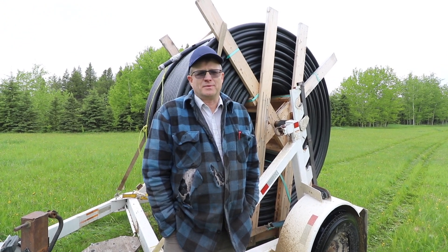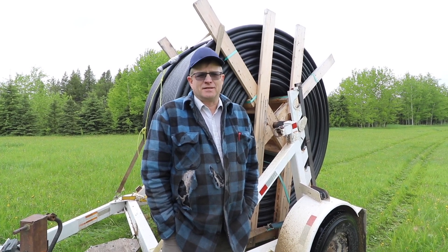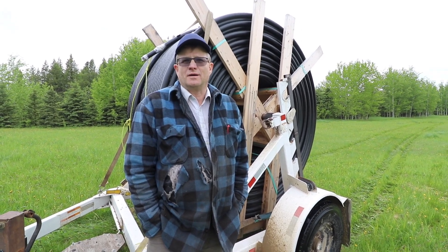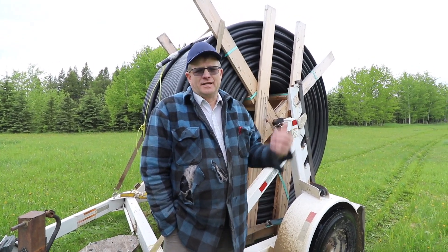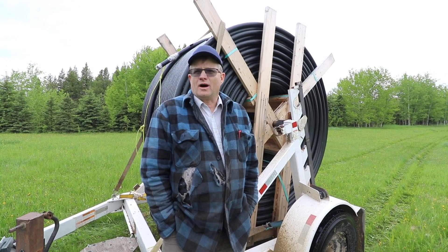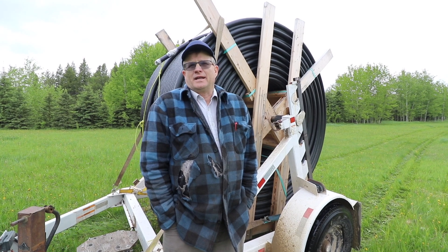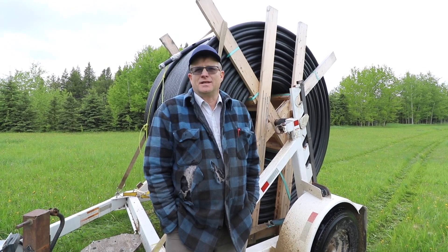Municipal pipe is high density. In comparison, if you go to a farm store or co-op, chances are you're buying low density pipe, which is more expensive and more meant for household use rather than pasture use. This pipe has a UV inhibitor in it — that's the one detraction from buying gas pipe or conduit in yellow or orange, which sometimes you can pick up cheap: it doesn't have UV inhibitor. But if you plow it in and bury it, the UV inhibitor doesn't make any difference. For surface use, this pipe has UV inhibitor embedded in it.